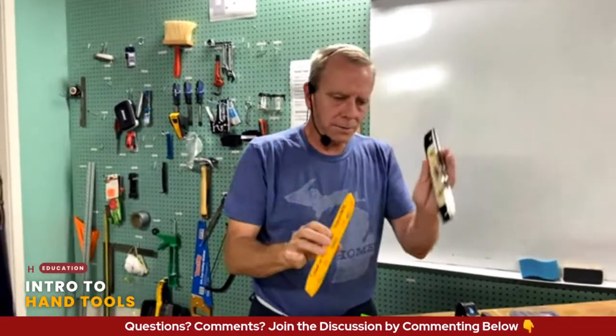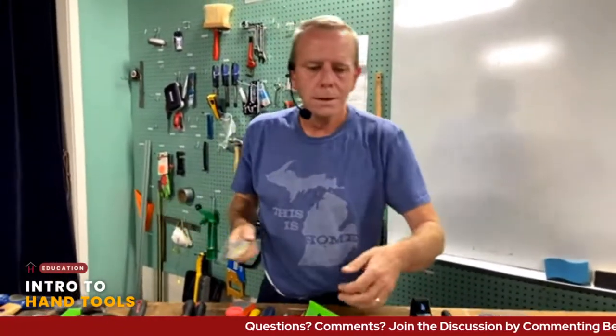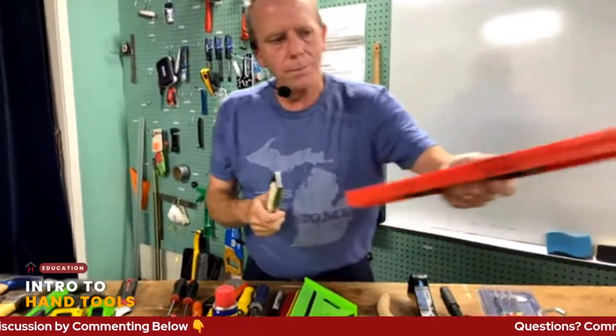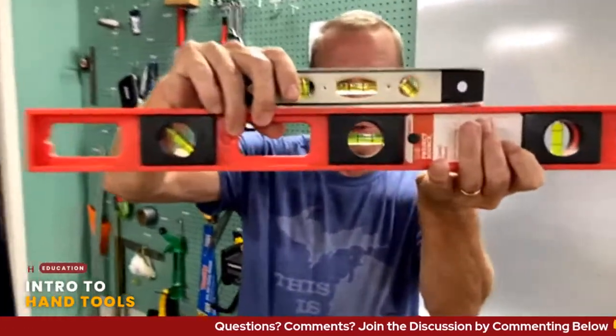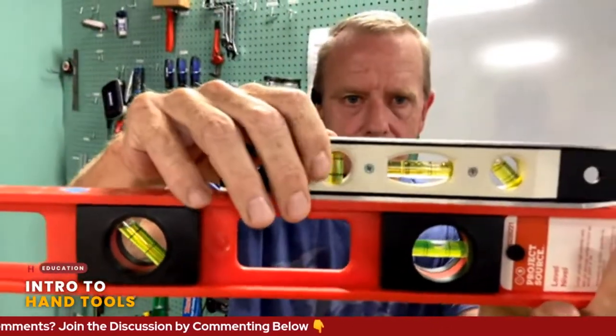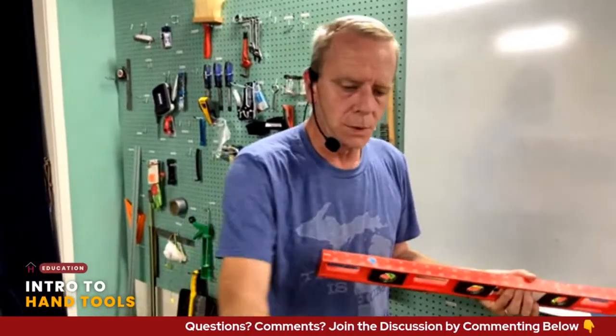Doesn't matter if it's plastic, doesn't matter if it's metal. You just want them to read true. Let's say you have one and you don't know if it's really reading right. How do you tell? Take it into your local store. Tell them, hey, I'm bringing this in, I just want to check something. They'll say okay, and they may put a sticker on it or whatever. Go to the rack and get a new one. You can stack them like this, and they both should read the same. If they read the same, then you know that this one's in pretty good shape. Because as they get dropped and stuff, they can get a little bit out of whack. So if you have an older level, you want to see if it's accurate. That's a simple way to do it.